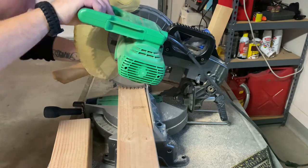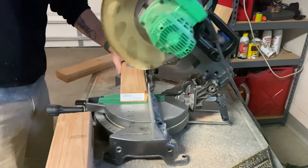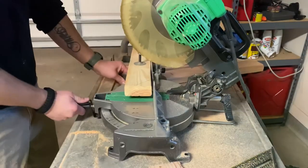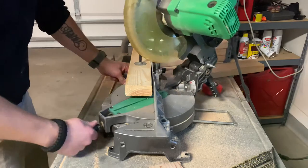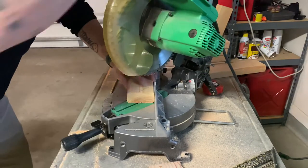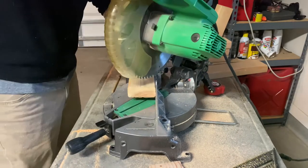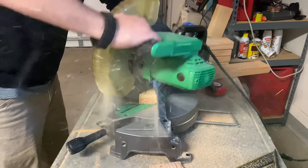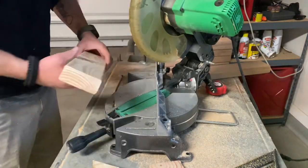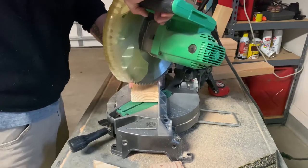First thing you wanna do is just cut all your boards to size. Once again, the cut list will be in the description, but you need a 4x4 at 42 inches, two 2x4s at 24 inches, and four 2x4s at 14 inches. The two 2x4s at 24 are for the arms, and the four 2x4s at 14 inches are for the legs. And then I just put a 45 degree angle on each side of the arms, and one side of the legs.